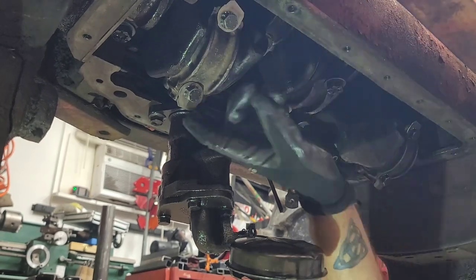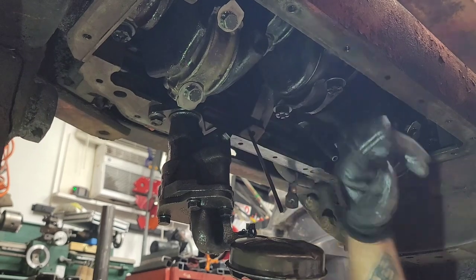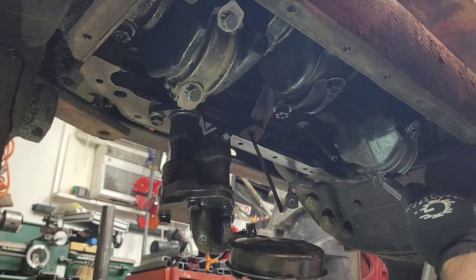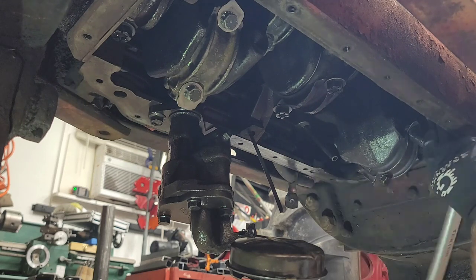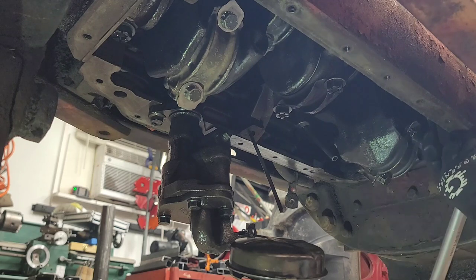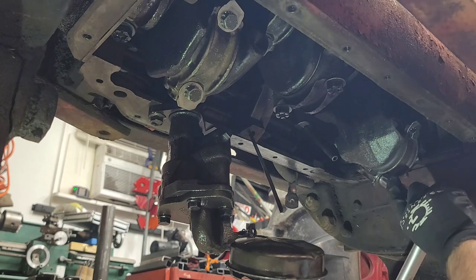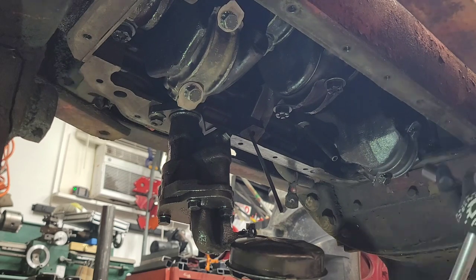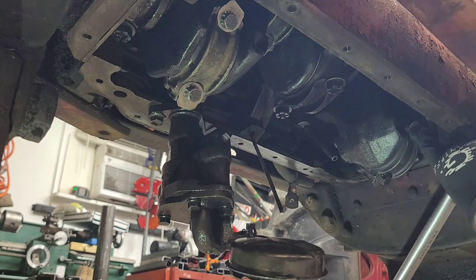That's it. After that point, what I'm thinking I might do is get all these torqued down, come back, and bend all these locks over afterwards. I'm not really in the mood to bend each one as I go. Just in case you run into a hiccup and you've got to take some back apart. I don't think I will, but I'm just going to do it at the end. So what I'm doing is just running these a little bit until each one feels like it's got about the same amount of pressure. And once it feels about right, do the final. Click. And like I said, I'm just going to go a hair more.